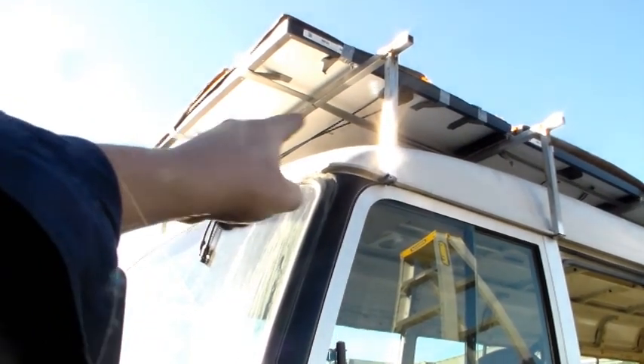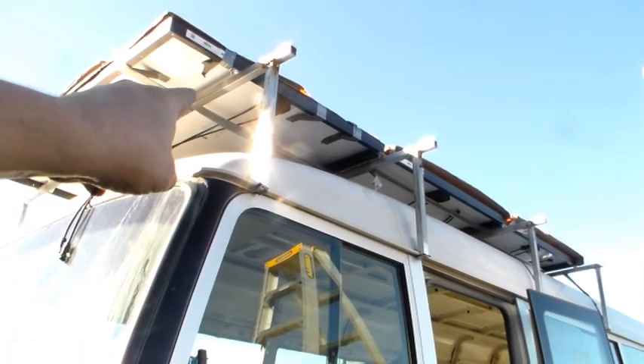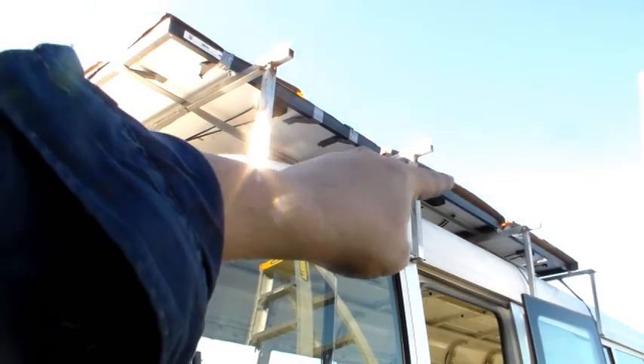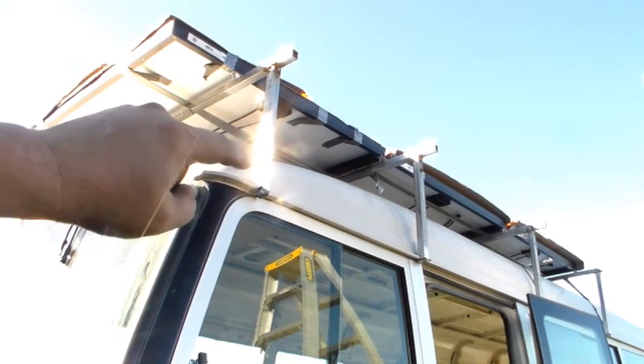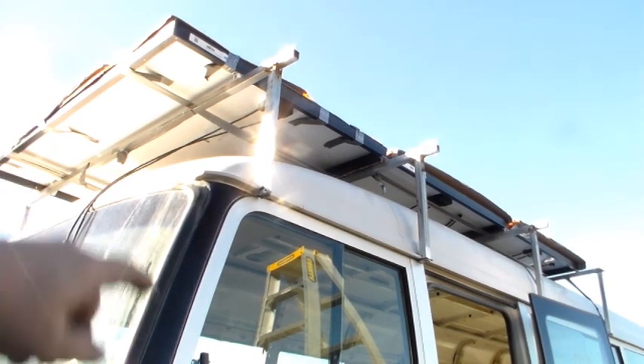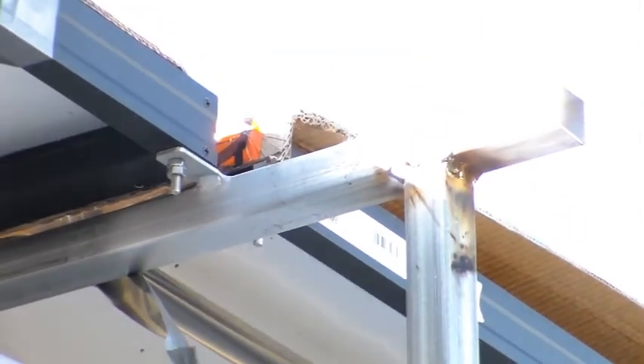You can see the solar panels are now fitted to the roof — three panels in total. I've welded up some frames out of 30mm by 30mm galvanized square tube to hold them up there. The panels bolt to tabs that I've welded onto the tubes.